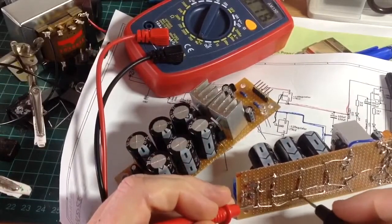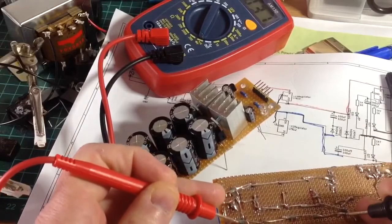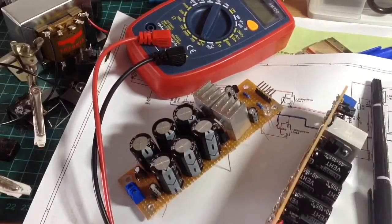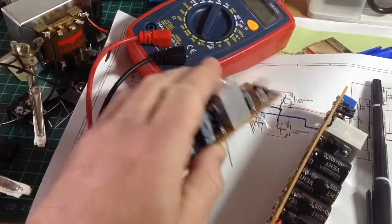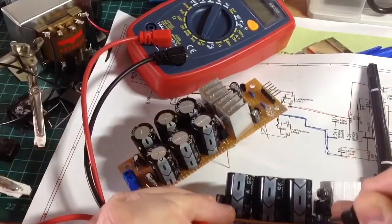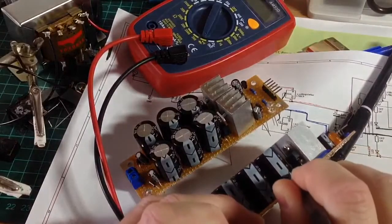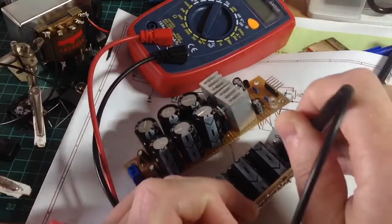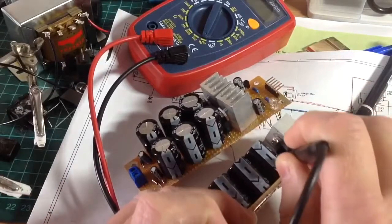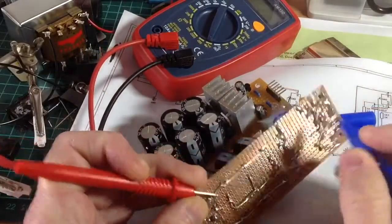So in building this power module from scratch, what I've done is I've basically taken the PCBs that I've purchased and built, and using a multimeter track the plus and minus 12 volt rails and the 0 volt rail connections to the components, and drew up a rough sketch of a schematic. And for this second build, I used KiCad to review what I wrote, and now I'm double checking all the connections, all the continuity between plus and minus, and making marks and checking off where the components need to be soldered.